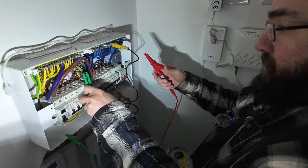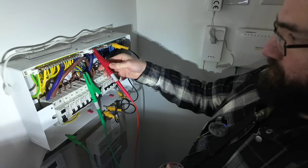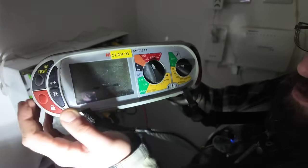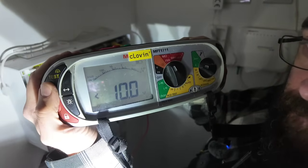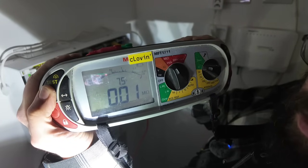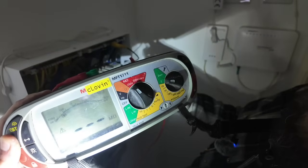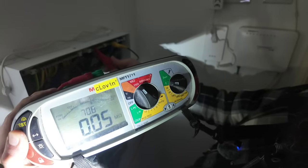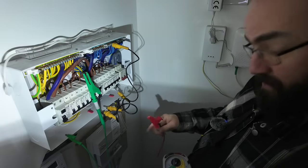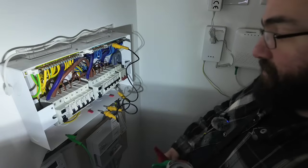I'm going to show you that even the budget Megger does the same thing. Selecting 250V on the Megger and carrying out the test — you can see 7.5 volts. It's protecting. If I take it off the load the reading flies up clear, but as soon as there's a load the voltage shoots right down. It automatically tries to protect any sensitive equipment. They're really good things, and it's not just the expensive one — even old McLovin does it.